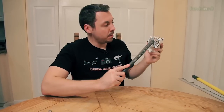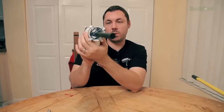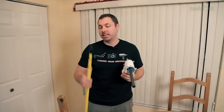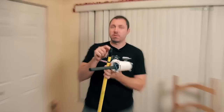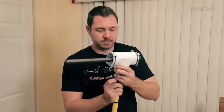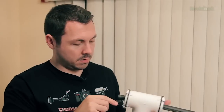Now that this is finished, we can take our shotgun mic and put it in the center of the rubber bands. So we have our shotgun mount and we're ready to mount it on whatever we want to use as our pole. Now with our DIY shock mount finished, we can take the pole of choice — mine being this light bulb remover extender pole, but you can use anything. Any broom is going to have this same half inch threading on the end, so we're going to be able to connect it to the half inch threading on this. And there you go — we have our DIY boom pole, which we can connect our XLR to.